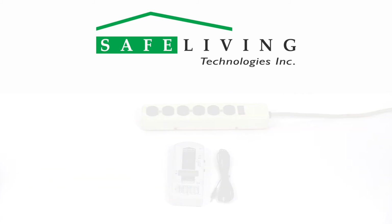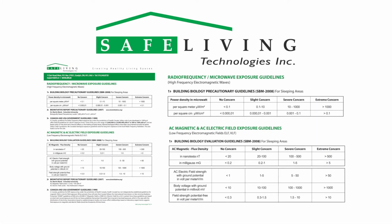Once you have determined the highest readings, compare them to the latest building biology guidelines. Currently, SBM 2008 is the most recent building biology standard. A reasonable goal after mitigation would be to have levels reduced to the slight concern level as shown below. Note that nanotesla can easily be translated to milligauss by dividing by 100, so 100 nanotesla would equal 1 milligauss.